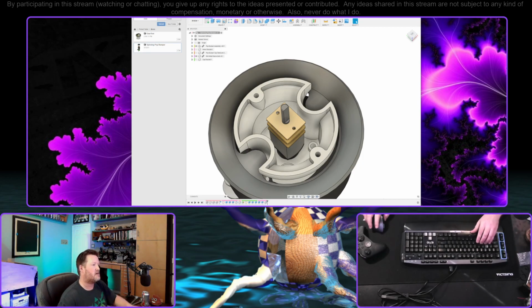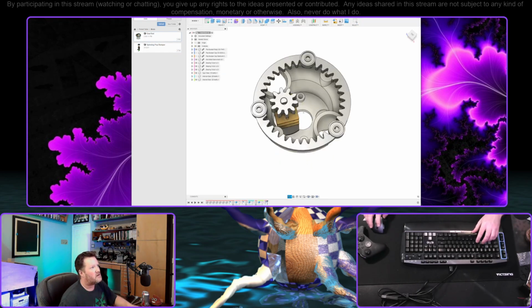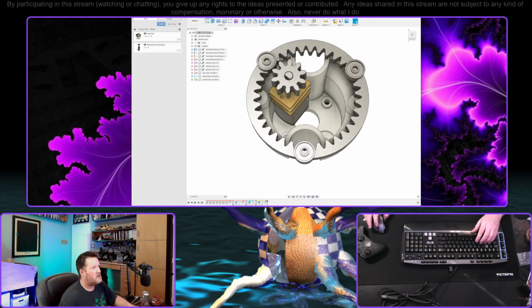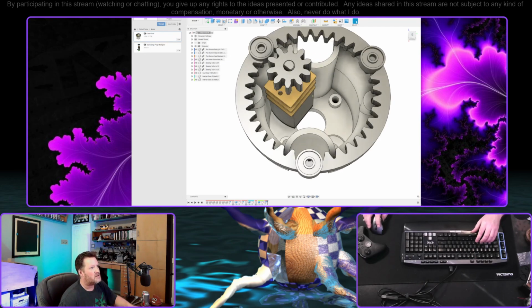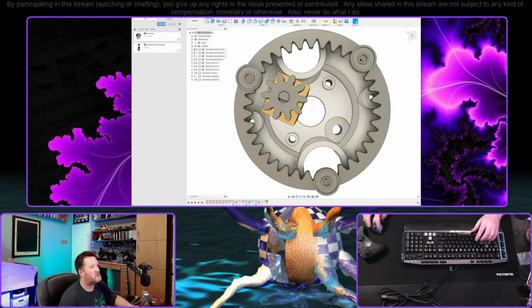But I started thinking about a way that we might be able to move this over. So these are the holes that the wedge lamp comes through. And there is precious little space sitting in the pop bumper cap body. But what I was experimenting with here is maybe doing some sort of gear drive system to spin this outer race, and then be able to put a light in here as well. It will spin in short spurts or re-rotate.